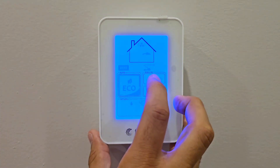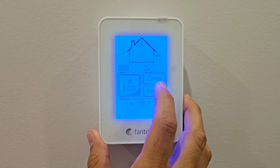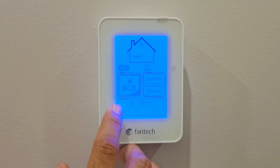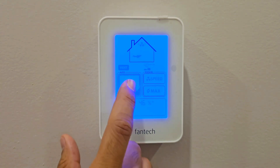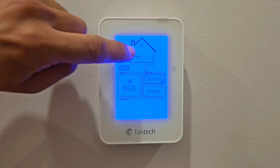This box shows the fan speed the HRV is running with. The Eco mode box — when it has solid lines, Eco is activated; pressing it removes that. You can manually change the speed by pressing on it. The Max button lets you quickly ventilate for 20, 40, or 60 minutes. In Options you'll find additional settings. Right now it shows indoor humidity at 46% relative humidity. A solid outline around any setting means that setting is currently activated.